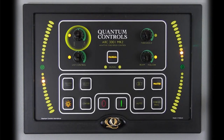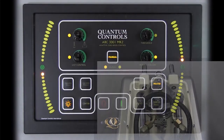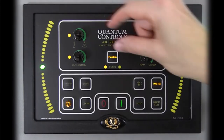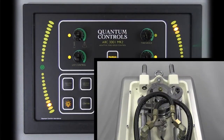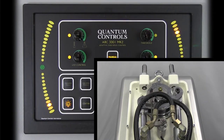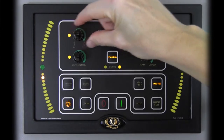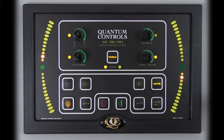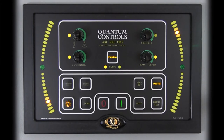The top left knob is the fin angle deflection knob, which controls the overall sensitivity of the stabilizer system. Turning this knob fully counter-clockwise minimizes the allowed fin deflection; as the knob is turned clockwise, more fin deflection is allowed until, at fully clockwise, the stabilizer fins are allowed to deflect freely to counter roll. If stabilizer performance is less than desired, try turning the fin angle deflection setting up clockwise. However, too much fin response can overcompensate, forcing the vessel to roll back and forth at small angles, making the vessel roll feel unnatural and jittery. To correct, turn the knob counter-clockwise until the unnatural motions cease.